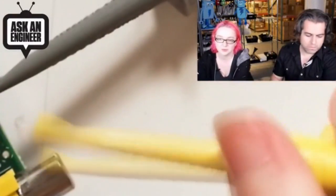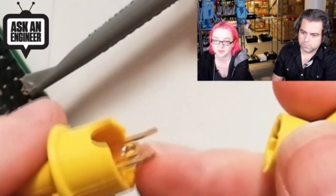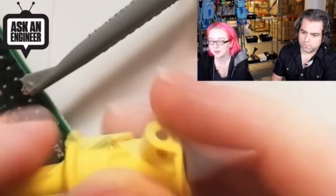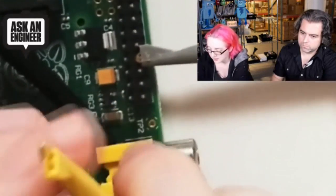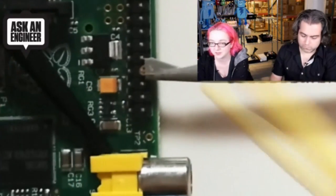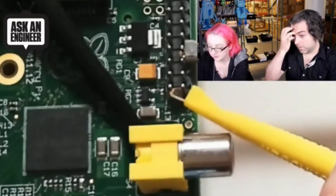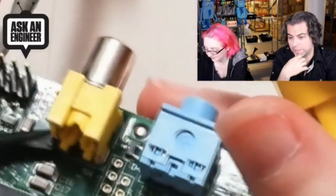For example, I've got this yellow one with its guts. These have a little solder tab — very easy to solder to. The micro grabbers have a little pin you shove a socket header into, but these you have to actually solder wire onto. You have a single hook coming out with a nice shroud that protects it and helps it make a good grab. Cheaper ones don't have all this extra molding, so they're more likely to short. You can grab onto a 0.1-inch header and you see it doesn't short onto anything around it. The quality with these things actually matters.